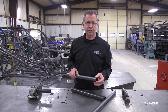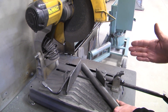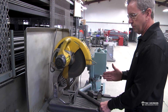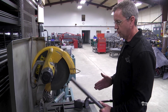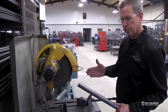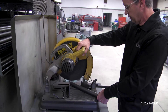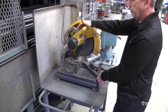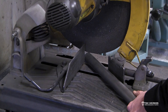I'm going to fit this with a chop saw cut — just going to eyeball it because I want to show you the basics of fitting with a chop saw. I'm not going to clamp this in the vise because we do this a lot, and I'm going to hold this by hand — so this is not safe. I want to show you how this can be done, but I'm telling you not to do it this way. I'm going to cut a little bit of an angle on this tube to show you how it fits onto another tube with a straight cut. Let's say a 45-degree fit to another tube. This is just a standard 14-inch abrasive chop saw — you can pick these up at Home Depot or Lowe's, they're cheap. We've also got a cold cut saw, but this is nice for just a quick fit on a tube.